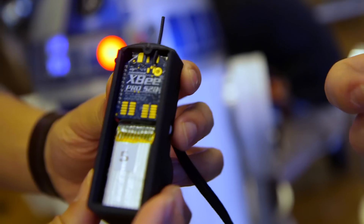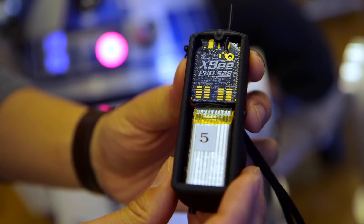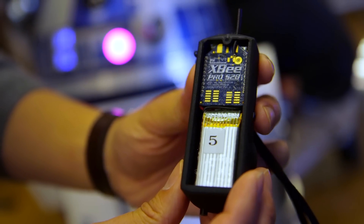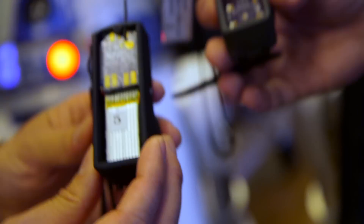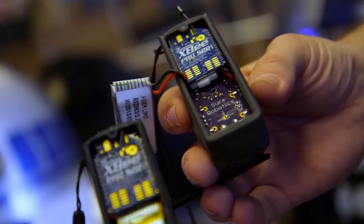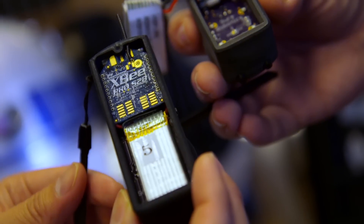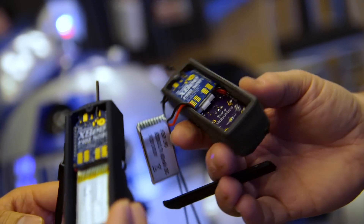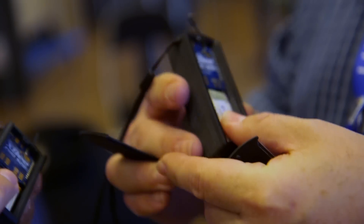What's the radio system? It's based on XBee — either 900 megahertz or 2.4 gigahertz — but there's a whole back-end system sitting on top of that, with logic on both sides and computers in there. It's a totally custom system I've developed that's now used in many R2s throughout the world, and in other robots too — Daleks, canines, and there's even a biped running around on them right now.